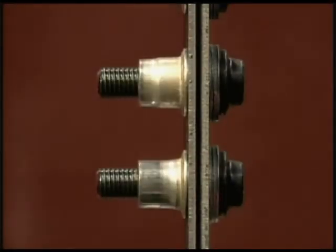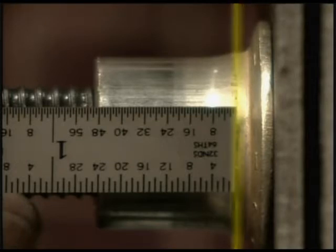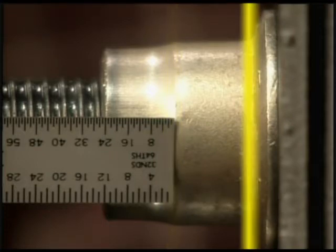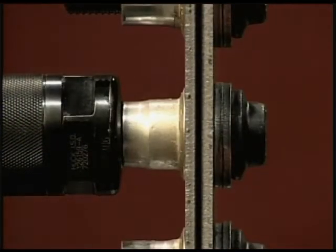To make sure the fastener is installed properly, all it takes is a quick visual inspection. First, on a swaged collar, measure the swage length from the top of the collar to the furthest point of the swage's curve. The line shown is a witness mark, indicating the length of the swage. On an incomplete swage like this one, it's easy to see that the collar hasn't been swaged all the way down to the bottom. To complete the swage, repeat the steps.